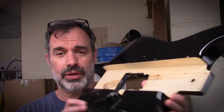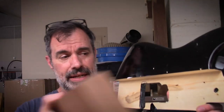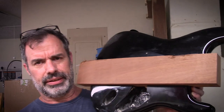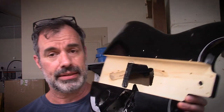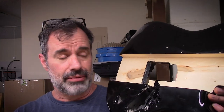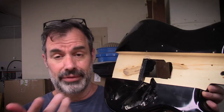I just keep cutting away at the can of worms and I have a big channel cut right through the middle of this guitar. I had planned to put this block of mahogany in there, and that may happen yet. As I keep cutting, I keep finding things like this really soft chunk of knot, and just bad routing and various other things all the way through. This appears to be basswood, so it's a softwood that's routing really well.